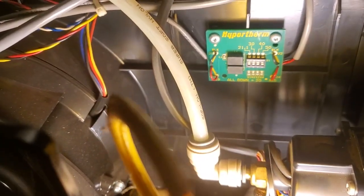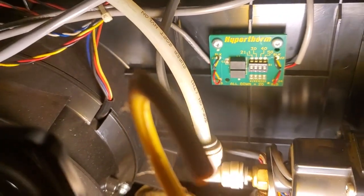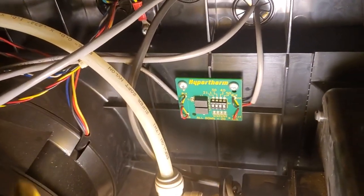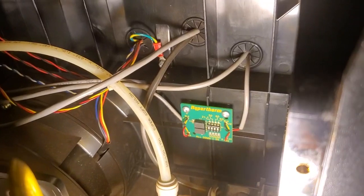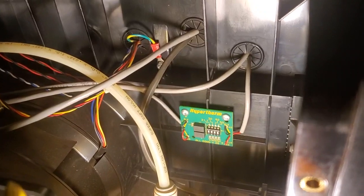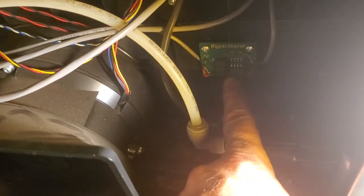I think the 21-to-1 is for Plasmacam. It's a special thing for Plasmacam. And anyway, that works great when it works. On my unit here, this Hypertherm 105 is 8 years old, so I'm long since out of warranty. And if you remember, I said earlier, my problem is that I'm not getting torch volts. If I measure with a meter at any of these points, I'm not getting the divided voltage from my main board to this board.